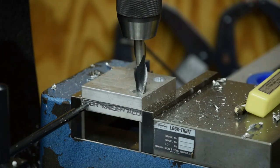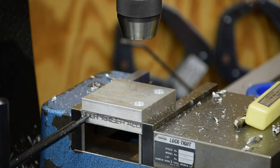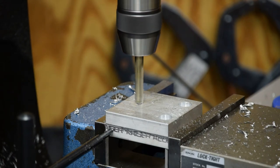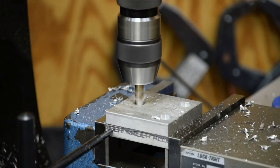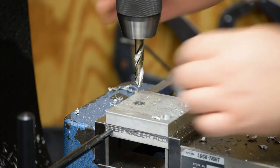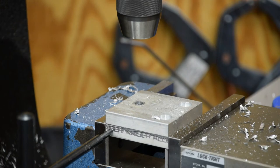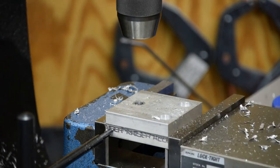I'm going to switch this out here and come back to pilot this hole for the clamp screw. I'll bring you back whenever I tap it. I'm just going to punch a little pilot hole through here so that the big drill doesn't have to push the whole web through. I'm going to have to run the knee down real quick. If you don't have something like this — one of these little cog things for a cordless drill — they are money well spent.